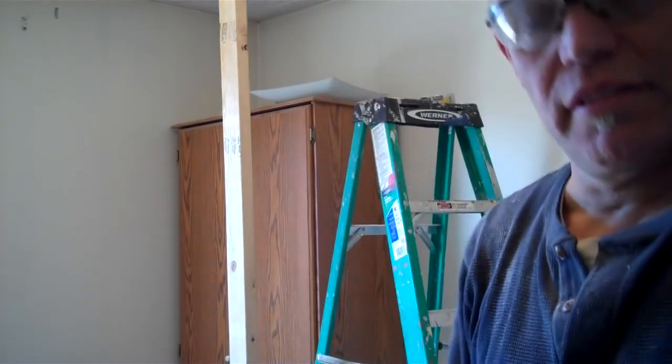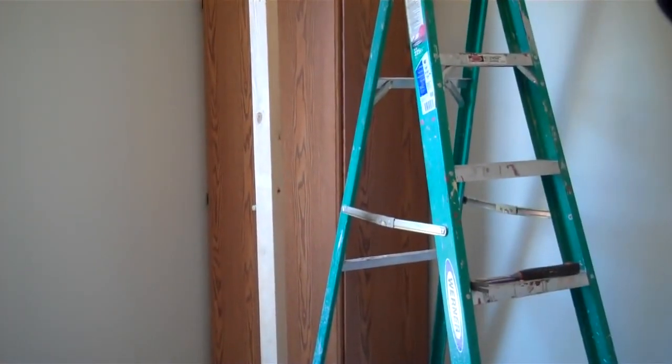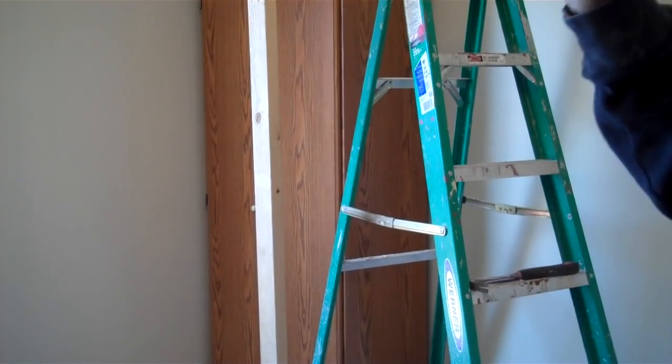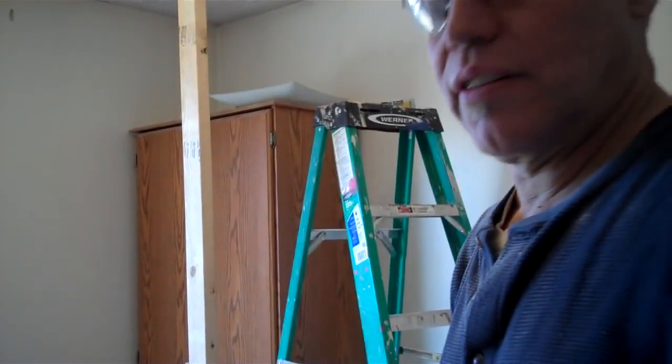Now these sculptured ceilings take a trained, very skilled plasterer to do. There ain't no drywaller putting these back together. But there's plenty of drywall ceilings you can save. The drywall has little teeny nails in them, but if they're sagging, like I said, build yourself a little jack. I'm just using my car jack. Works great. Slowly jack it up, put the nail in. As it gets up there, put it in a little further, and then plaster over them. You save these things.